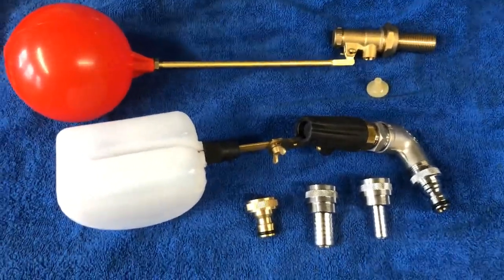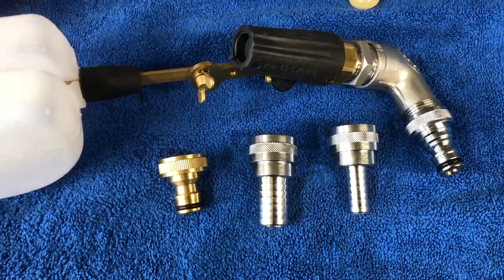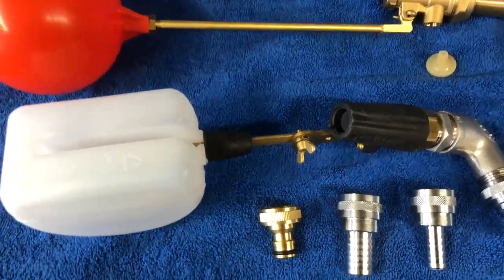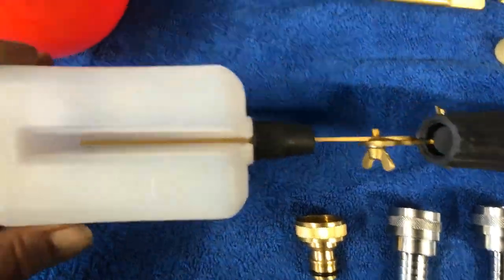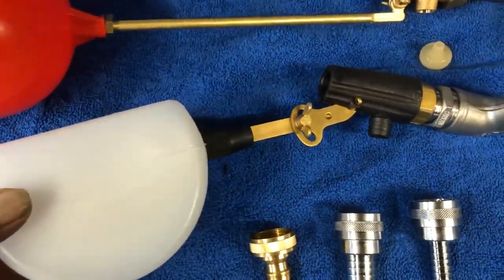What we've got here is two types of ball cocks. We've also got on the system itself different ways, obviously for different sizes of tanks. What you've got to remember is the width of the tank that you're using. When we're using a 250 litre water tank, we would use this ball cock system — this can be moved backwards and forwards and altered. It's a very short type of ball cock.